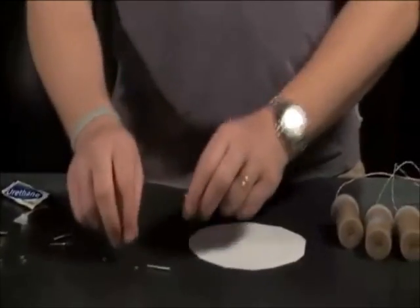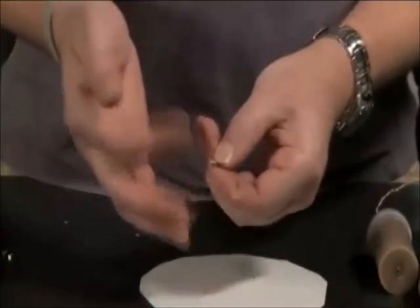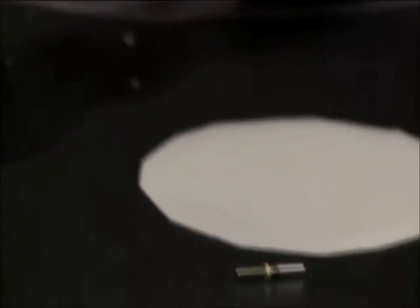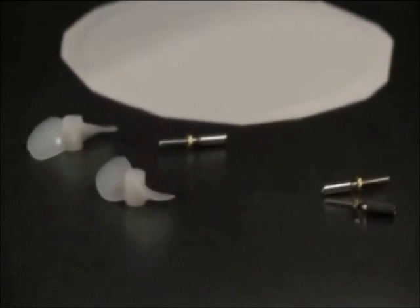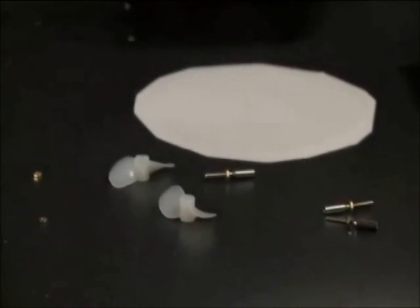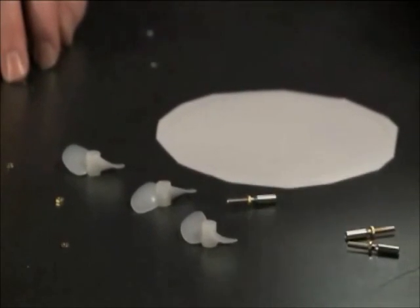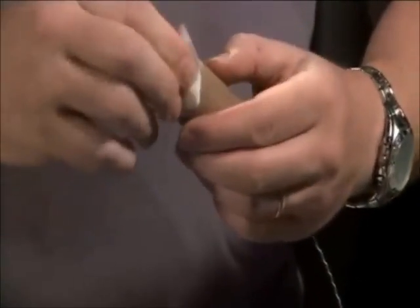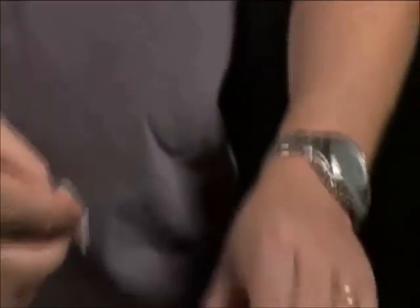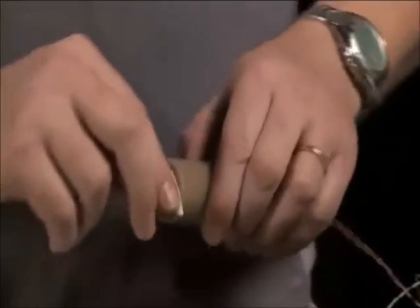To make sure that we're ready, the first thing we want to do is put the first of the small brass nuts on each one of our shafts. Go ahead and push it all the way up until it stops. Do that for all three of the shafts. Now we want to make sure that the shafts, the propellers, and the final nut are each laid out where they're accessible. The last step before getting the epoxy ready is to clean off each of the motor shafts with the alcohol cleaning pad included in the kits, to make sure the epoxy will stick as best as possible.